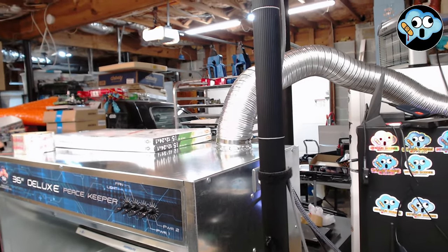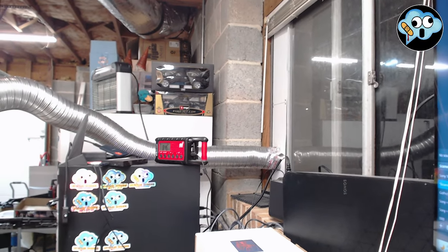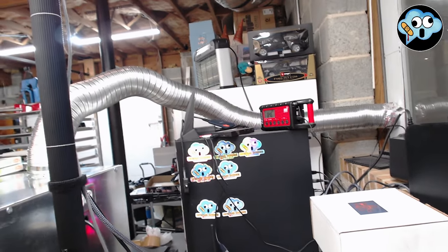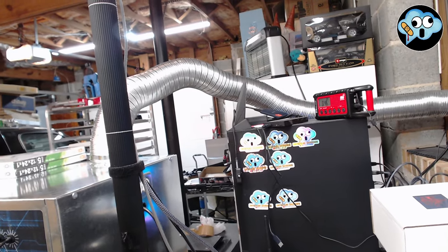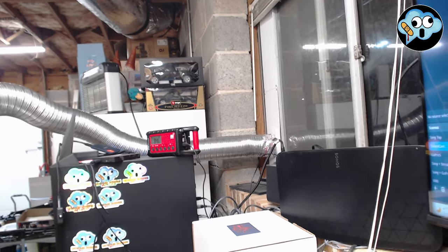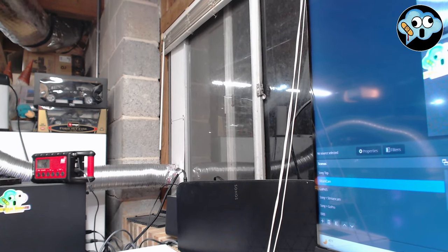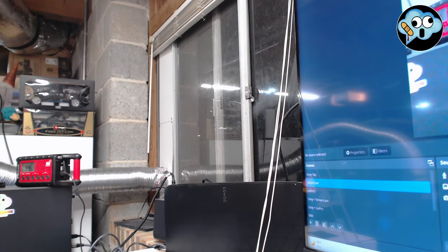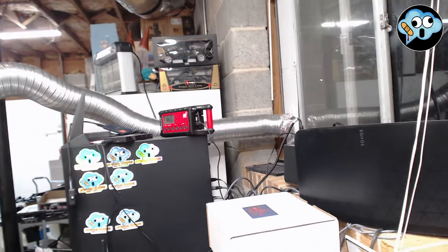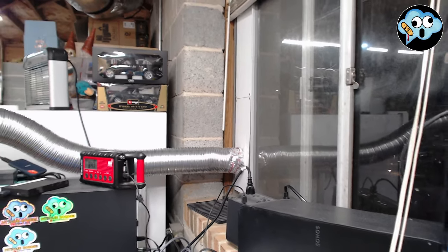We're back from Home Depot. We played with this thing, then went to the Bahamas, and now we're back. I got my window vent in, and I bought semi-rigid dryer duct at Home Depot. If you're going to leave this in place, I like the idea of the semi-rigid. However, if you're like me with single pane basement windows that leak a lot of cold air and you're going to pull this thing out and seal everything back up when you're done painting, just get the cheap floppy super flexy stuff. Because this semi-rigid stuff already started to break — I have aluminum tape on there to heal a wound that I made.